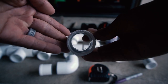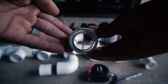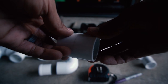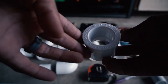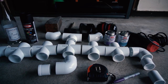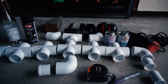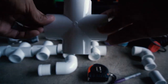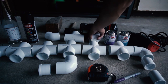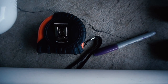If you're unsure if it's the right fitting, you can turn it to its cross-section view and it's embossed. You have to verify all your parts before you buy because people never put things in the right place at the stores. You'll need two one-to-one-and-a-half-inch bushings — I actually bought three and I'll talk about that more later. Three one-and-a-half-inch elbows or 90-degree; make sure they're street so they're not threaded. Five one-and-a-half-inch crosses. One one-and-a-half-inch tee. Two one-and-a-half-inch 45-degrees.